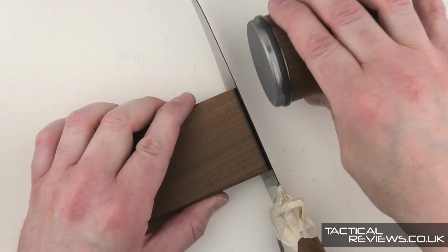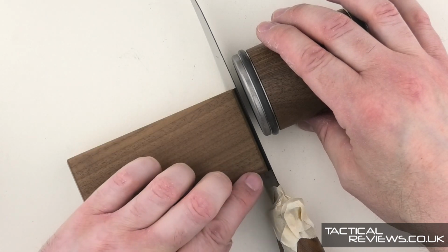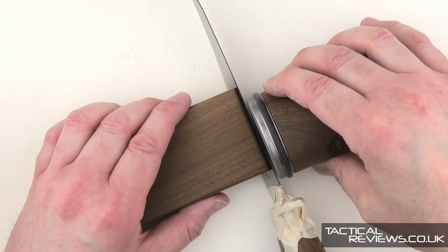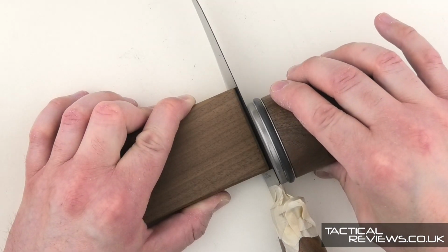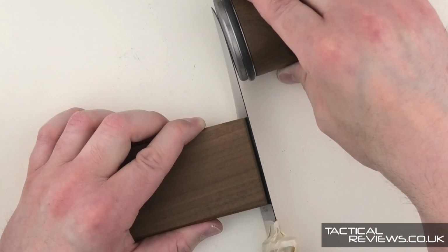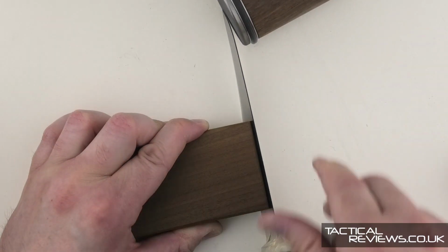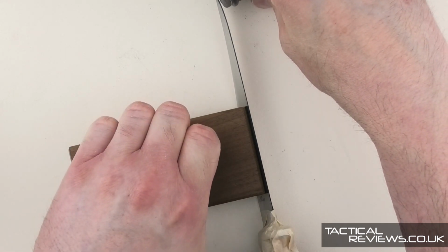And typically, when sharpening, the center is the easiest pass to get, the heel and the tip the hardest to get sharp. And you can kind of see actually why. Center, nice and easy. Heel, a little bit awkward. The tip, well, unless I get that stone to the right angle, I'm not even working it. So I'm actually going to have to support the handle. It's lifting.